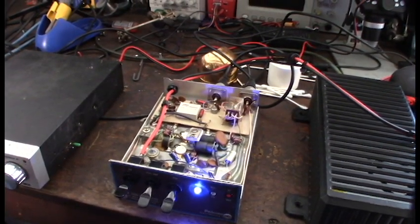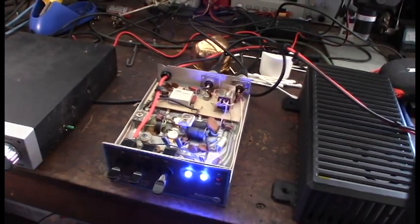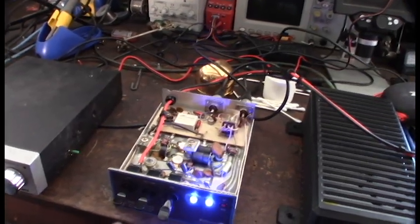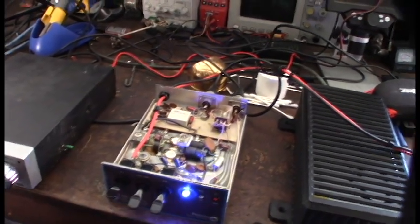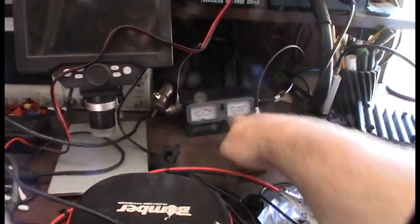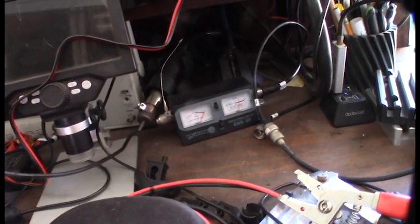These cables aren't great over here — I wonder how the preamp doesn't work. The static you hear is on my SDR, not the radio. I had the wrong scale — I was sitting on the 100-watt range. So that's putting out about 80 watts.